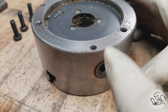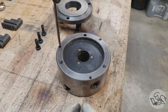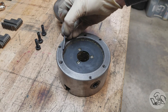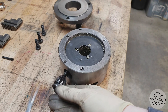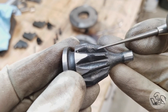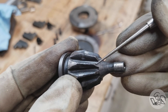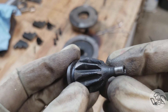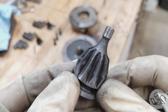It probably doesn't matter for the pinions but it doesn't hurt. The pinions are held in place by set screws that have a machined shoulder on the bottom that runs all the way down and engages a ring on the pinion — that's extremely typical. These were not even tight for some reason; I guess it doesn't matter because they're held in place by the backing plate. With those out we can pull the pinions — you can just stick your pinky in there if you don't have fancy forceps. Getting a close look at this pinion, you can see some wear marks where it engages the ring gear. It's sintered metal, not a machined gear, and probably fairly soft. This lathe is five years old with pretty heavy use, so it's in good shape for its age.